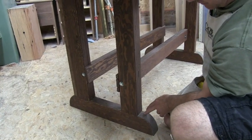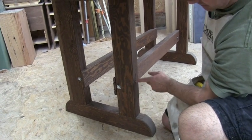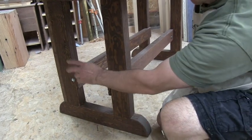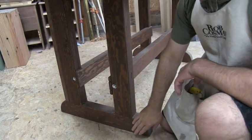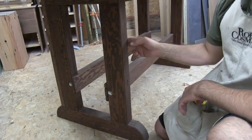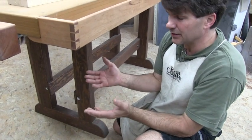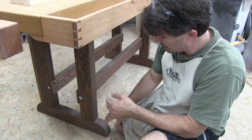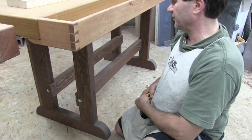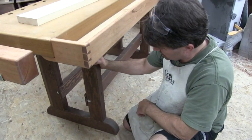The third piece on the foot stops right here, and the third piece on the upright goes all the way down. We finish it right across the other side, and the fourth piece of the leg stops right here at the top. So you're essentially building a mortise and tenon joint all at once. Everything is glued and stapled, so when you're done you end up with something two and a quarter inches thick by four inches — very strong, very stable.